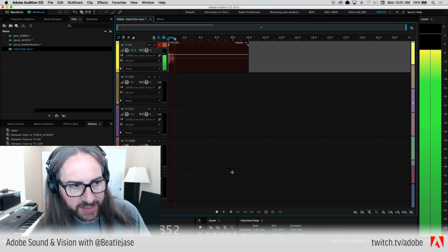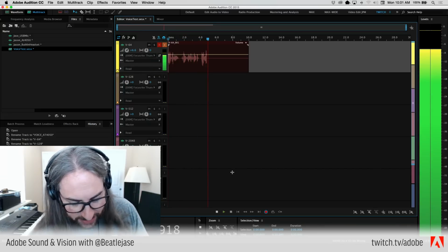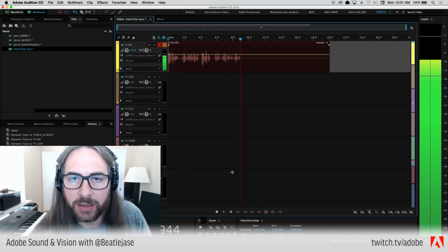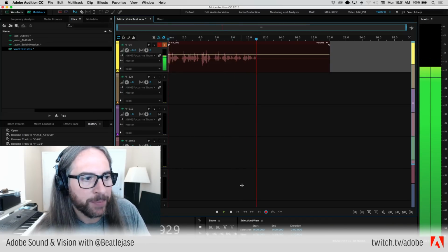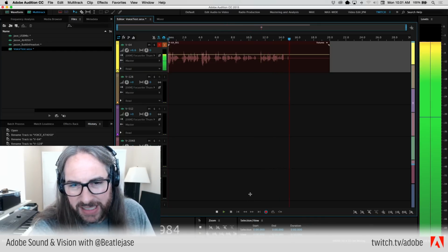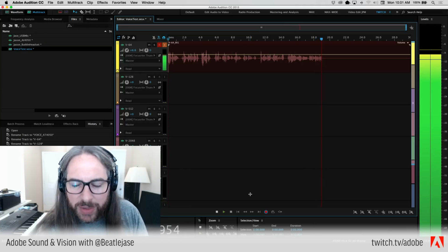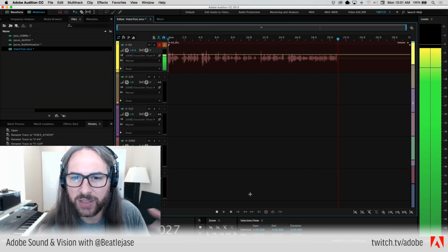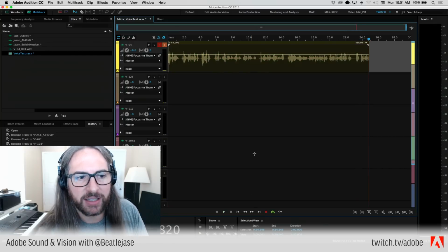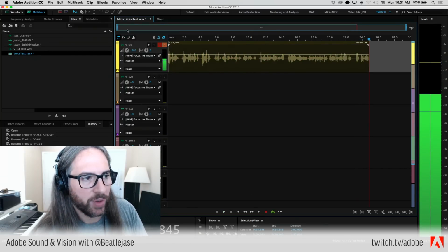So when I record this now, it's fine. I can see my level. It sounds good. I know exactly what's happening and what's being recorded and how it's going to play back. Okay, that's at 64 samples. Now I don't know what you can hear. It might sound slightly chorused, maybe just a little bit, not enough to be bothersome. It's certainly not slapping back or echoing. This is a pretty legit level of latency.